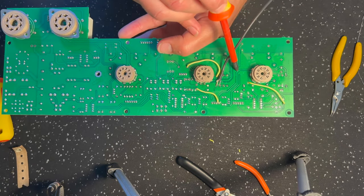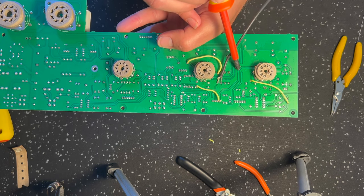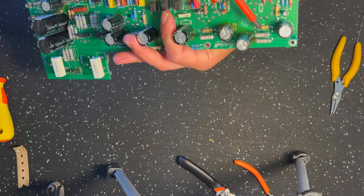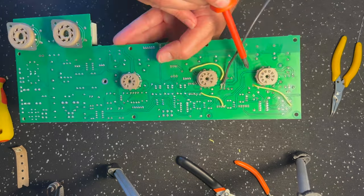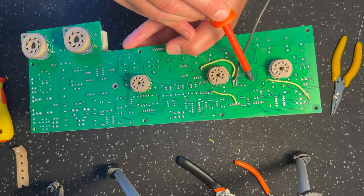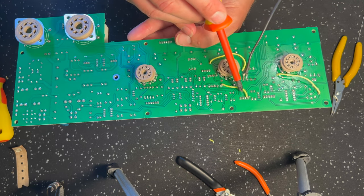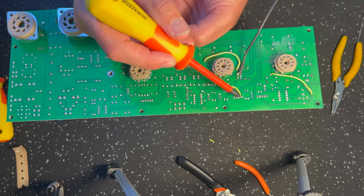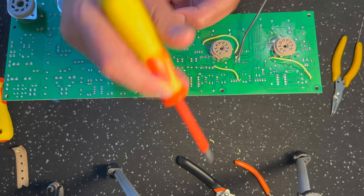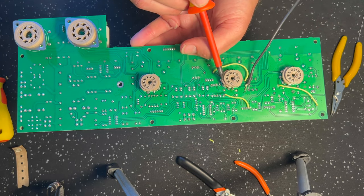This track here from the same triode from V1B, this is the plate. You can think of that as the output, right? That's the plate resistor. But this is the track here that's carrying the amplified signal from the plate. And this connector here is, rather than in the stock origin that would go out to the tone stack, what we want to do is run it into V2B.